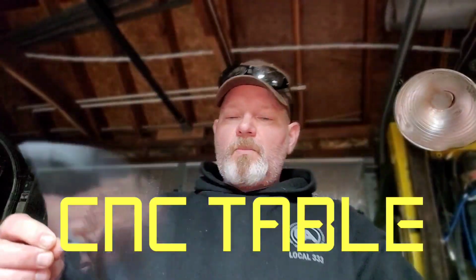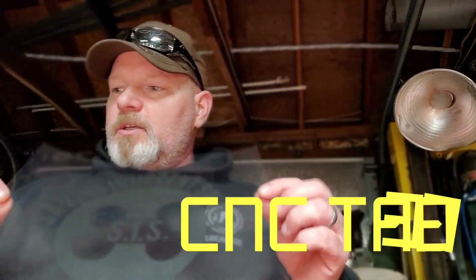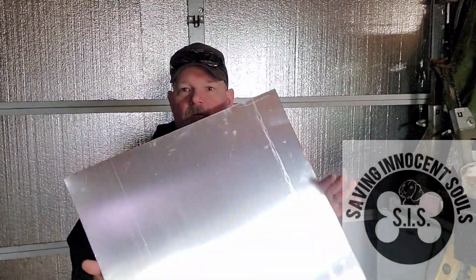But here's what we got. You print it out on this film, okay? And then you'll lay it over. Now let me just show you here. Okay, so I got the camera repositioned here, and I have a piece of sheet metal. This is aluminum, and this is 050 thickness, series 3000 aluminum, 3003 something something. I'm not exactly sure, but that's what I'm using for these.